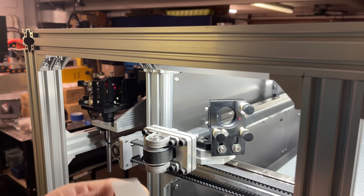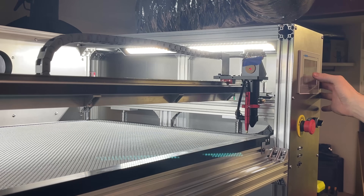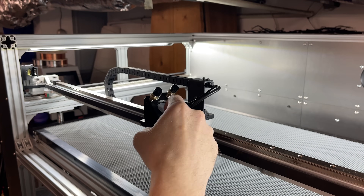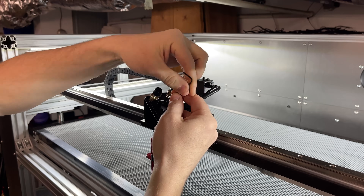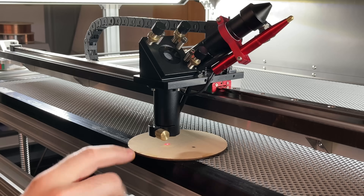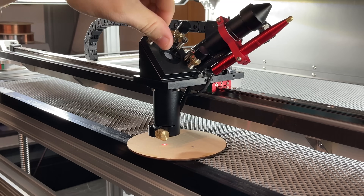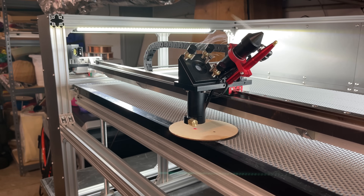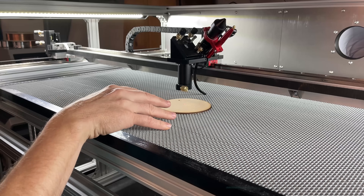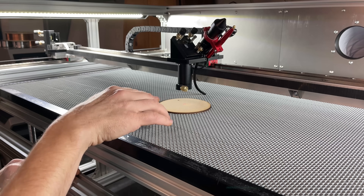Let's go ahead and get this second mirror installed. It looks like it's hitting the hole in all four corners, so let's go ahead and install the third mirror. I'm going to remove the nozzle while we see if we can get it centered. The red dot looks a little off so let me make some adjustments. The beam looks like it's pretty well lined vertically. I'm not going to go crazy getting it perfect because my table is still not secure and wobbles a little, but it's pretty close. Let's go ahead and install the focusing lens.